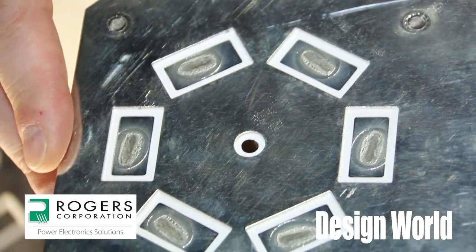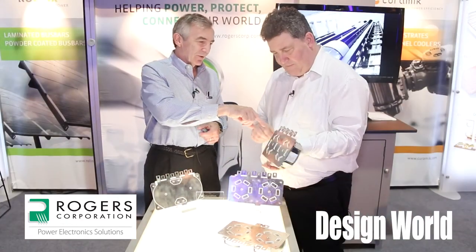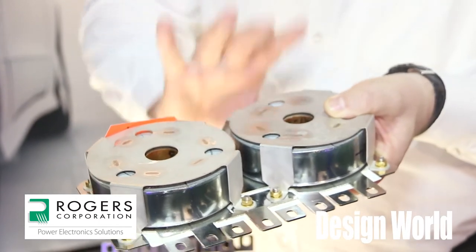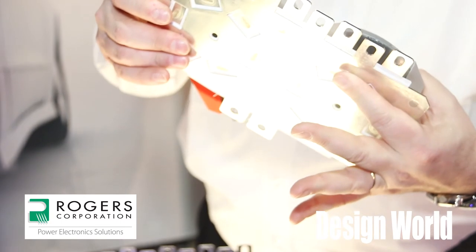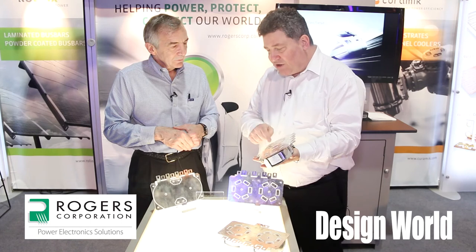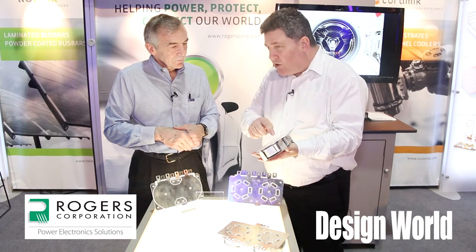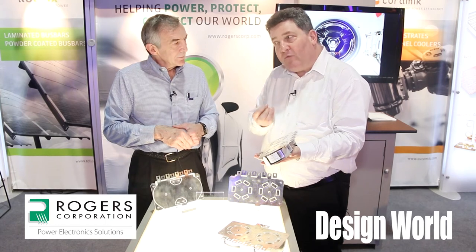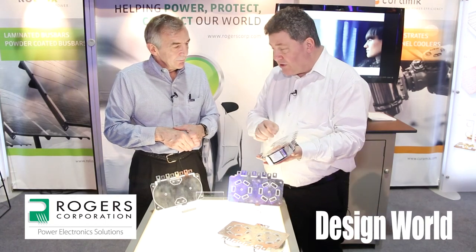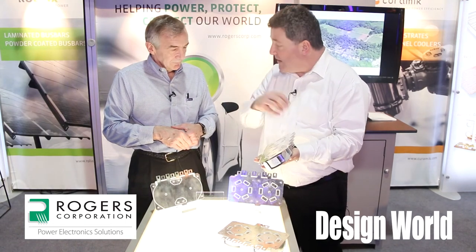I noticed that these are spot welded at multiple sites on this side, and there's also an interesting cap on the other side — is that an advantage? Good question. The typical capacitor has only one connection port for plus and one for minus. Here we have multiple connection points for both plus and minus, which means you avoid hot spots — if you're running 400 amps through a terminal, multiple terminals mean you avoid generating excess heat.